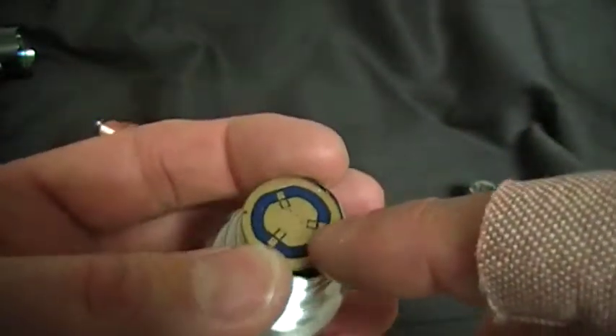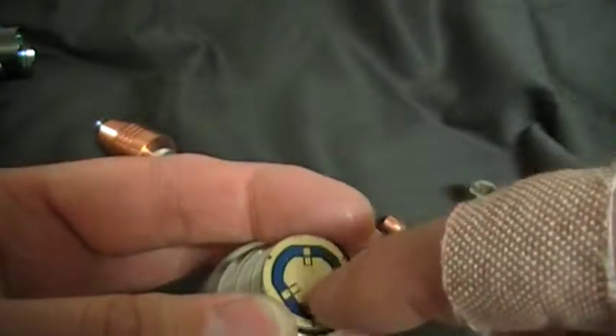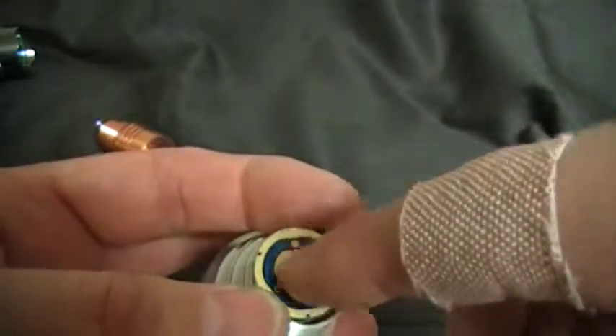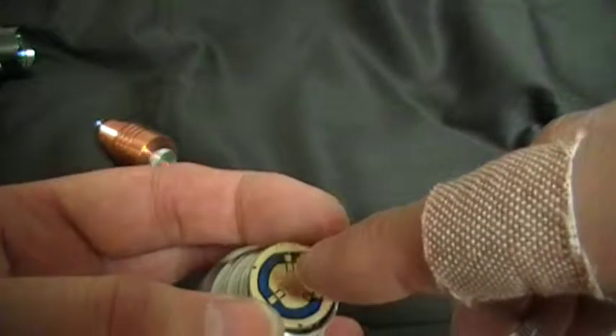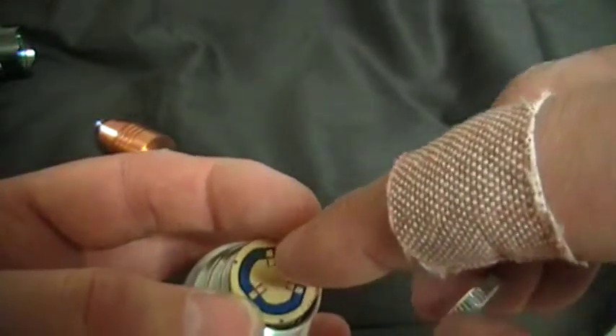These drivers are very sensitive. You cannot get anything on these outer three squares. The center three, you're okay. Put your big solder spot on the driver. Get your spring real good and hot, then add solder — heat it right there and put your spring on.